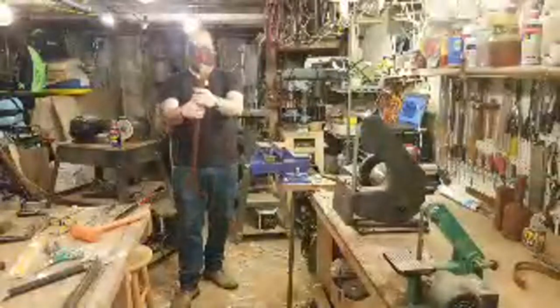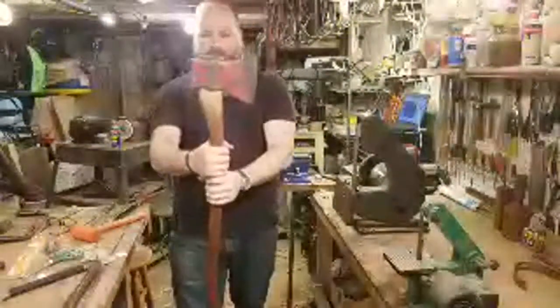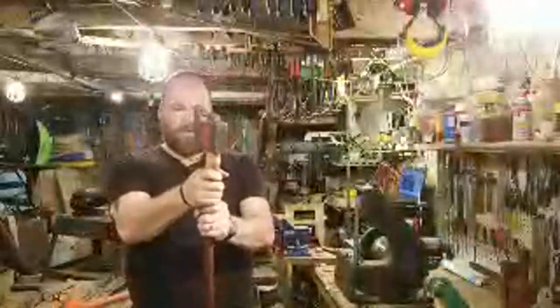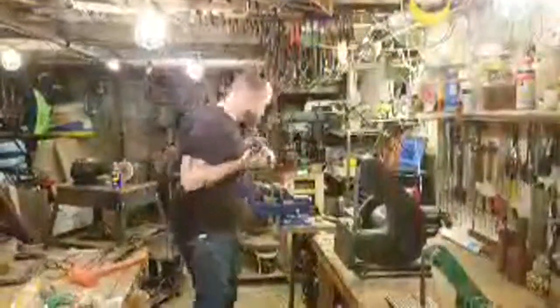All right, we're getting pretty close. Got about half an inch or so above the eye now. Still want to bring this up a little bit, so I think I'm still going to take a little bit more down off of here, but I don't want to do too much. This will bring it down. Getting nice fit up on both sides, on the cheeks that are coming down, nice and tight. Just a little bit of gap, but I think that's mostly just from the chamfer. So when I do my final drive home, I'll really be able to seat that down nice and tight on there and get a wedge in there, which we'll do shortly. But I think maybe one or two more passes, and that should be good.